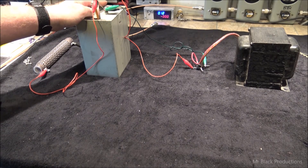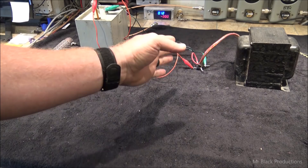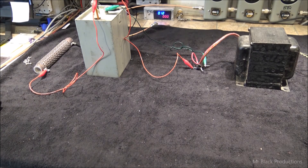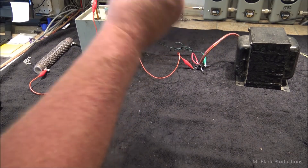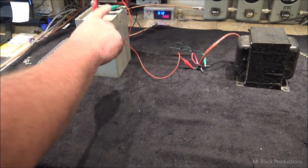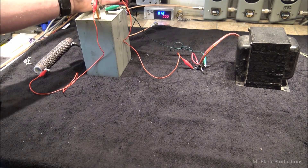We're not going to cover that. We're going to cover the soft start circuit. What I'm trying to teach you is that this is a dead short — when your electrolytic capacitor, your oil film capacitor, your filtering device — which acts as a resistance to the AC that might be rippling past your diodes, which are your one-way check valves in the universe — is a dead short when you first turn your box on.